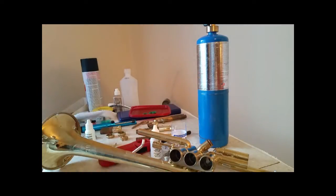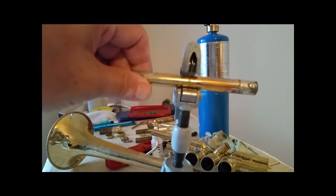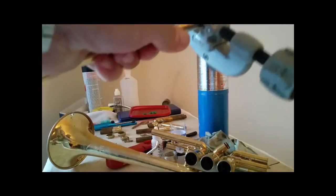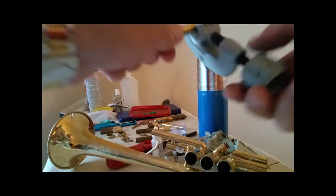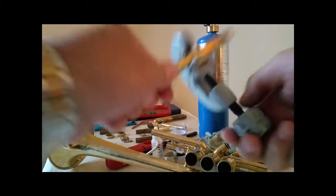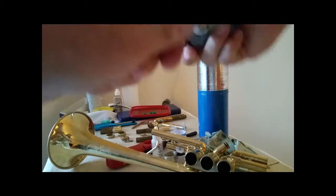So I'm going to pause you for a second, and I'm going to mark my 2.5 inches back. Okay, I got it marked, and I started going around with the pipe cutter. And don't put too much torque on it by tightening on the handle until it gets easy to turn, or else you'll end up bending it in. I'll show you what I'm talking about when I'm done, because there's really not any way you can keep from doing it, but I just gradually keep tightening it up as I'm going around.